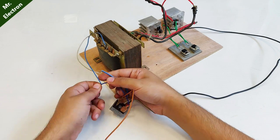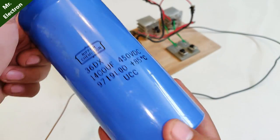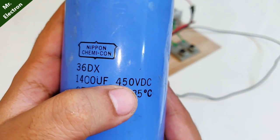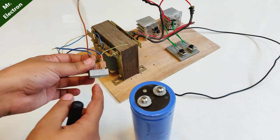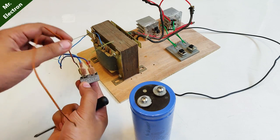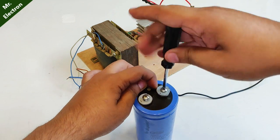Just for safety, I'm going to use this large DC capacitor — 1400 microfarad with a voltage of up to 450 volts DC. We have to make sure the polarity is correct. This orange wire indicates positive from the rectifier, so positive will be connected to positive. Okay, positive has been connected.